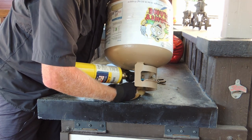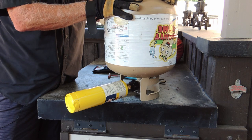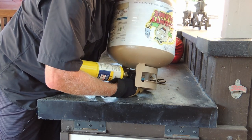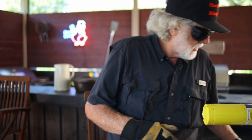I have seen other people say you can go several minutes and you are still transferring liquid. So open the valve, and whenever you think the transfer is done, close the bottom valve. Then turn the large tank back upright. Double check that you closed the valve. Then remove the small cylinder by turning it counter-clockwise. There is some propane pressure built up in there — you'll probably see or hear the release. Just a small puff.